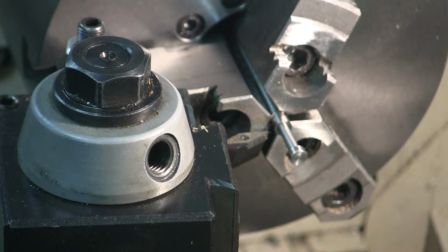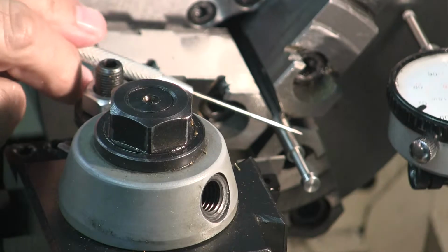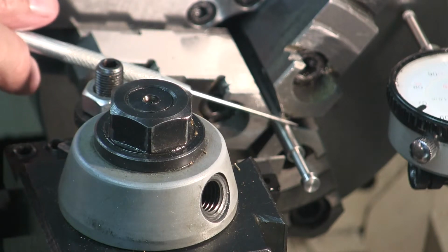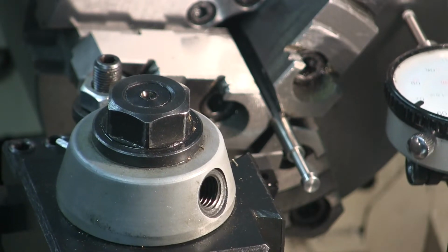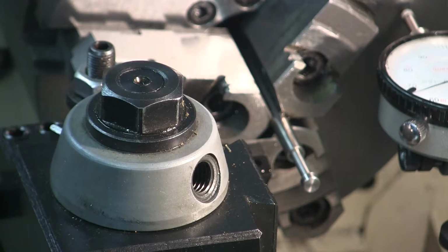And the next operation in the lathe with this piece is to remove it from the stock. All right, I'm going to separate the valve from the rod stock. I want the base of this valve to be 0.400 inches long, so the cutter is 0.063. So I'm going towards the chuck 0.463 inches. There's 100, 200, 300, 400, went past it, 6, back up, 3, right there.